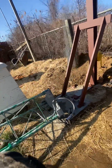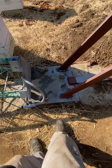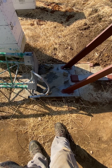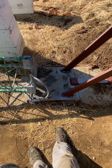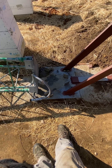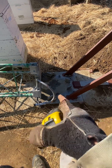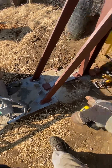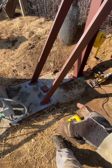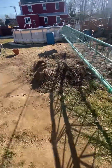For the concrete foundation — somebody's probably wondering — it's a 28 by 28-inch hole, just inside the 25-inch base plate. It goes down 72 inches and then hits a gravel pit, probably another six inches of bluestone. That's 1.2 yards of concrete, which came out to about 12,800-something pounds of force for the earth counterweight. No matter what pressure is put on there, the counterweight will counter-react it. It now has an additional 1,200 pounds on its side pushing down to keep that tilt tower from pulling up.